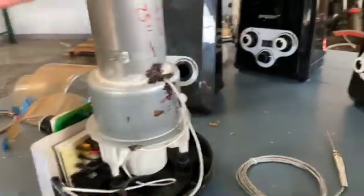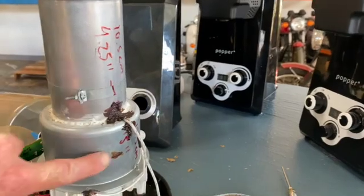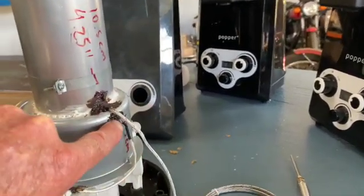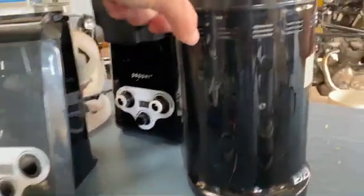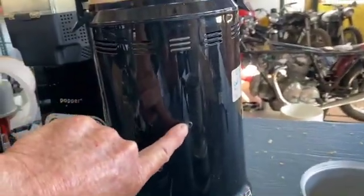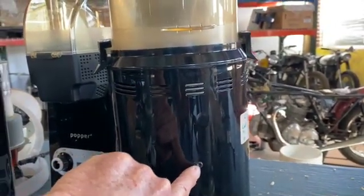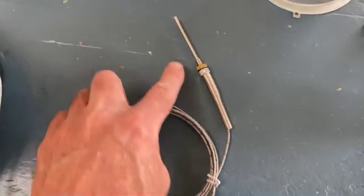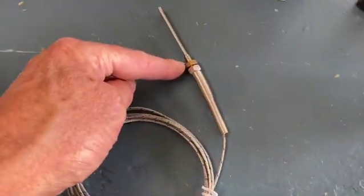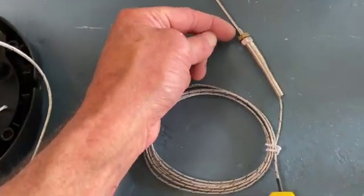I can see that I was measuring for where I was drilling my probes in here. On this one I had run a probe into the housing. This is early on because that's a simple bare thermocouple just above where the vents are, so that's going to be a really nice bean probe. The way I was doing that: if you measure from this lip down, the safe measurement is 13.5 centimeters. I was using the Sweet Maria's thermocouple — this unit here — which is 53 millimeters long. That's perfect for getting into the roast chamber and it works on a lot of poppers too.